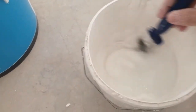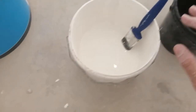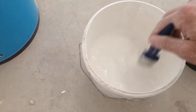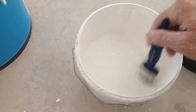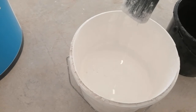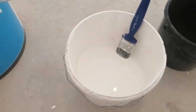There's no real ratio to it — you just want more water than paint, obviously — then you mix it all together. I'm just using a paintbrush because I only need a little bit, but if you're doing a wall or room you need a bit more, so you can use a stick or a bit of batten to mix it up. It's called a mist coat for a reason because it looks misty when you paint it on the plaster. Make sure you're using clean water. That's the consistency you want — you can see it dripping off the brush. It's a very messy job because it's very watery, so be prepared to get covered in paint. If you've got carpet down, make sure you cover it with sheets.